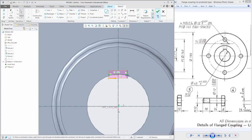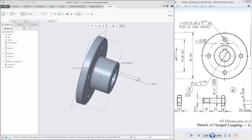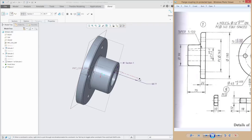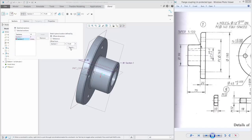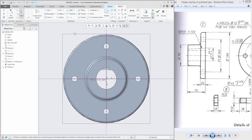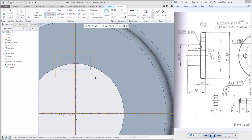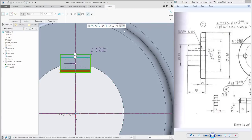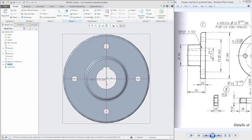Then change the direction first. It should be extended inside, and the length of the keyway is 75 mm. Put the value 75 here. Next, go to the first placement and sketch, and second sketch, and now draw another rectangle at the other end of the key. Calculate the value and put it, this one is 14 and this one is the bigger end, draw this and apply it. Now zoom out and go for extrude cut. Apply it. Now we have done the keyway.